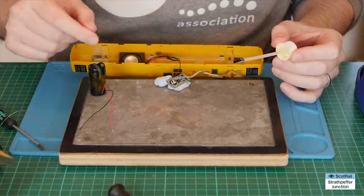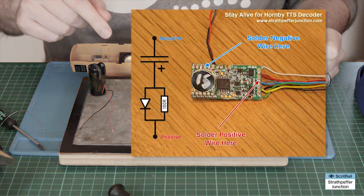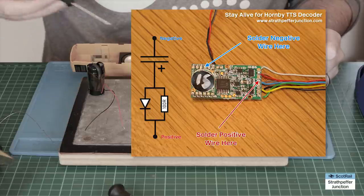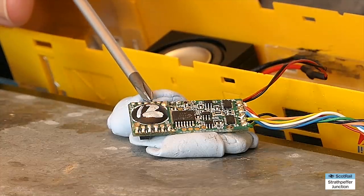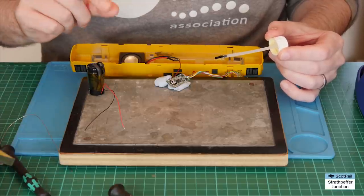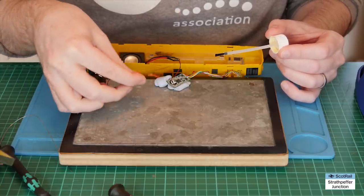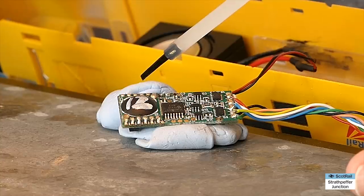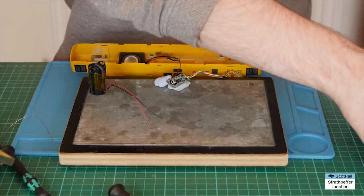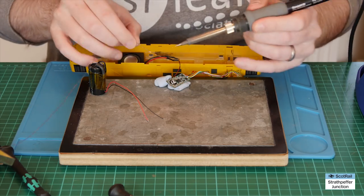Going back to the diagram: what we want to do first is connect the black wire — the negative — from the stay alive onto a pad here on the chip. The one we want is the third one along. What I'm going to do is pop a tiny bit of solder flux onto that and flow just a slightly additional bit of solder onto the top, which will give me a better solder platform to then solder the wire onto. So I'm applying a tiny little bit of flux onto that — you don't want too much because you don't want the solder flowing everywhere. We'll bring in the soldering iron with a nice clean tip, pop a tiny bit of solder on it, and come in here.